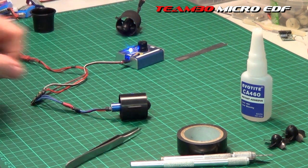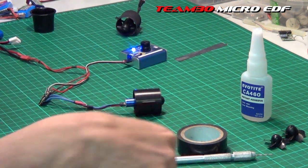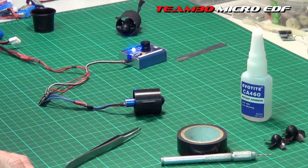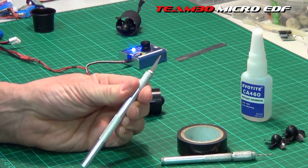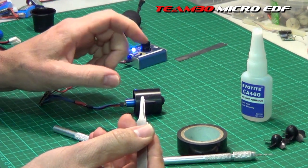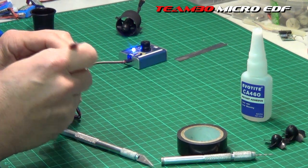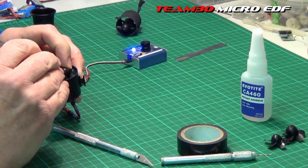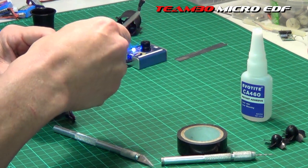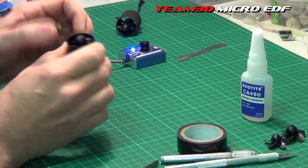The video just cut out just as I finished. That thing's pretty well balanced now. Here's the next step: get a thinner piece — this is a just-making-sure step. You don't need much weight, not if you've cut the blades right. What we're going to do now is find out does it need more weight or less weight on that blade, because it's sounding pretty good. I'm going to go over one blade and put it to the outside on purpose to cause more weight — thanks to inertia, centrifugal force. This will tell me whether it got better or worse.